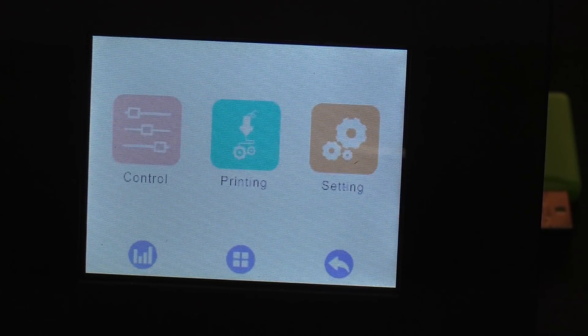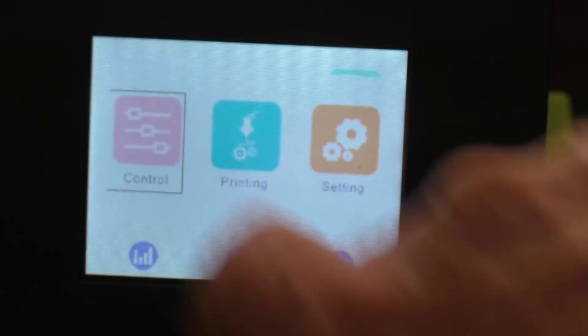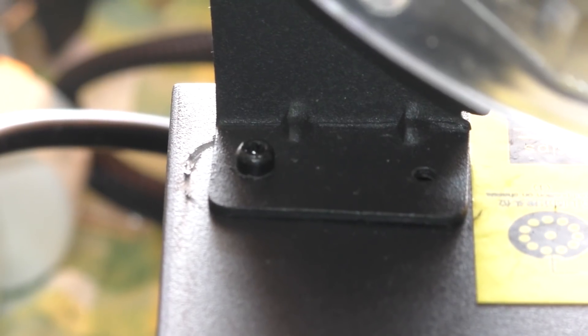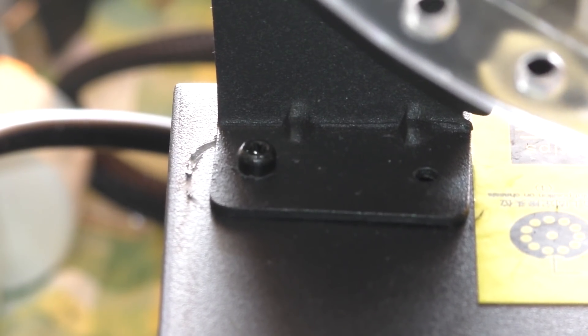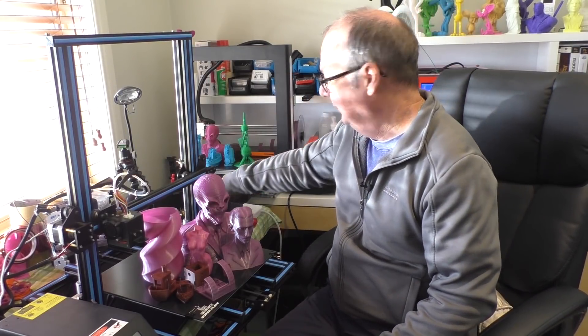It has a really nice color touch screen which works very well. It has a spool holder which screws to attach to the top of the control box, but I had problems with that. One of the holes in the control box was too big — they take an M3 screw, one hole fits M3, but the other hole is M4 or M5 size. Consequently you can only screw it down with one screw. Not that important, I guess, but one of those things that shouldn't happen.